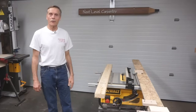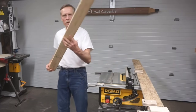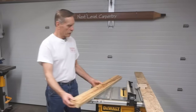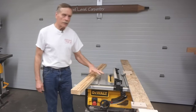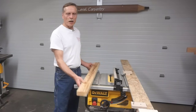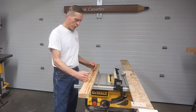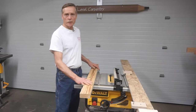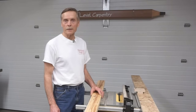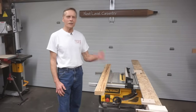Hi and thanks for checking out Next Level Carpentry. In this video I'm going to show how to cut a straight edge on a crooked board by using a simple fixture and a jobsite table saw. It's a great method because it allows you to salvage boards that are otherwise too crooked to frame with, and with a straight edge to work from you can make accurate furring strips and save the nice straight lumber for other places where you really need it.